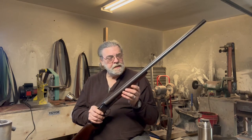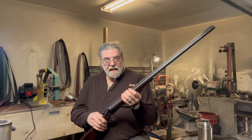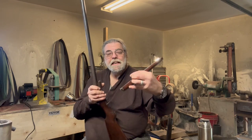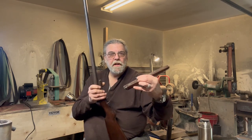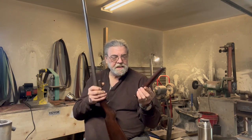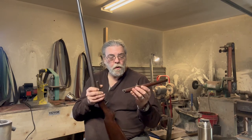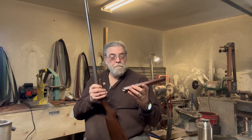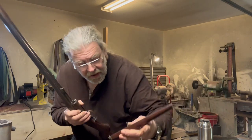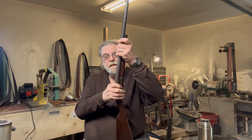What I did with it was restore it to function — a case of conservation rather than restoration. I cleaned it up and determined what the issues were. One issue was that the little arm in the forearm had no spring tension. Typically there's a little coil spring that makes it stick up; this one was missing. I couldn't find any evidence there had ever been one, so I delved into my bin of random springs, found a coil spring to push on the back of the lever, and that holds it in position and works just fine — makes it very easy to reattach the forearm.